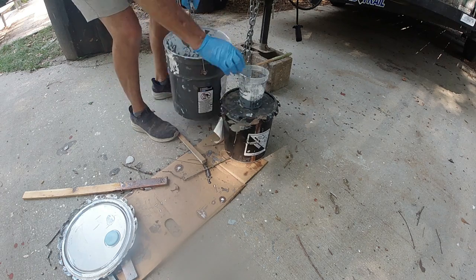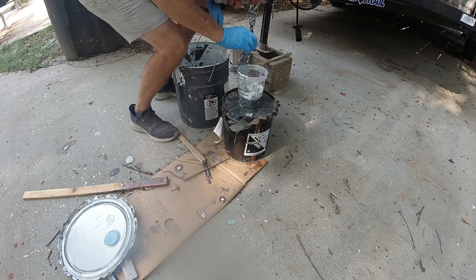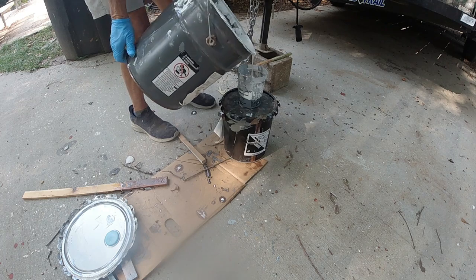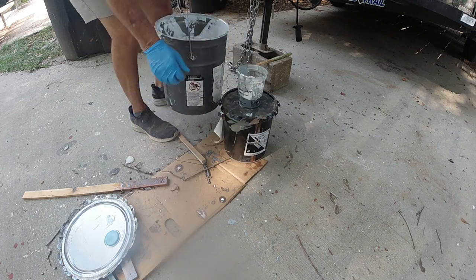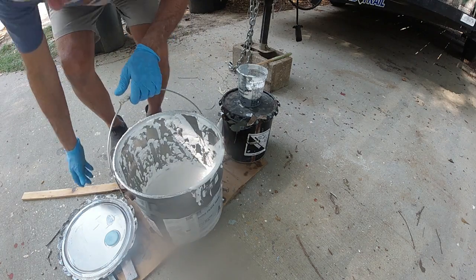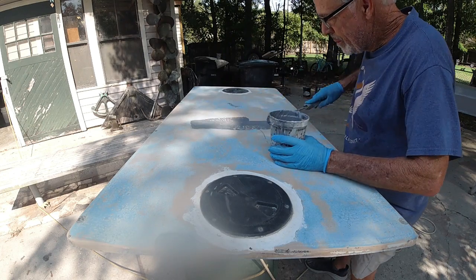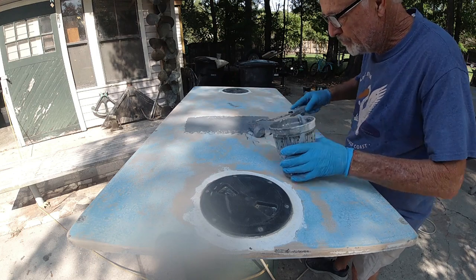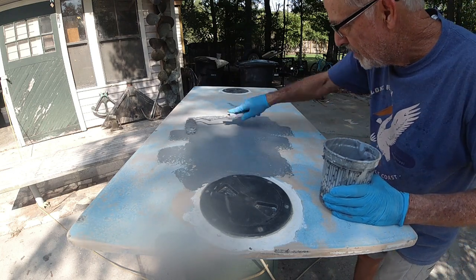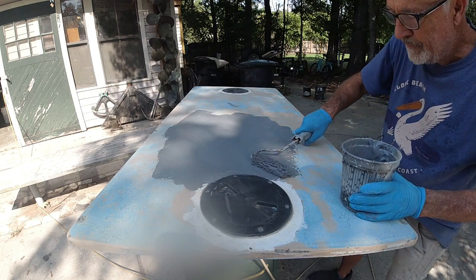It's kind of tricky to mix. Typically I put the thicker component of any epoxy in the cup first, let it settle and read what I have in ounces, then adjust the thinner component — because let's say you want 10 ounces, sometimes by the time it settles you have 12 or you have 8. Adjust the other component, pour it in as accurately as you can, and mix well. Coating the top of the top does very little good other than making me feel better. I put the flap disc on the grinder, got a little loose paint off — I have no idea what I'm painting over, could be latex for all I know — but I gave it two coats. It'll never see the weather and nobody will ever see it, but it's done.